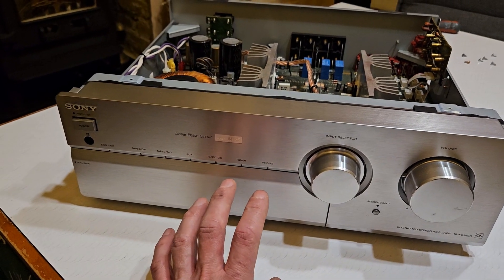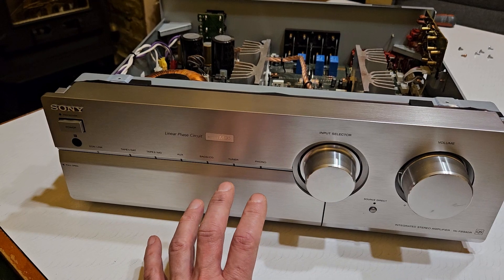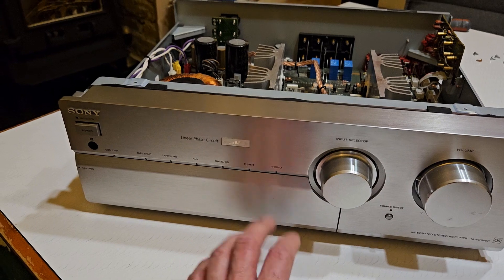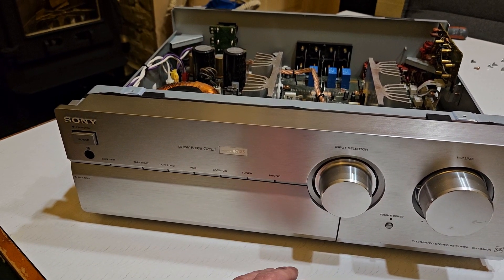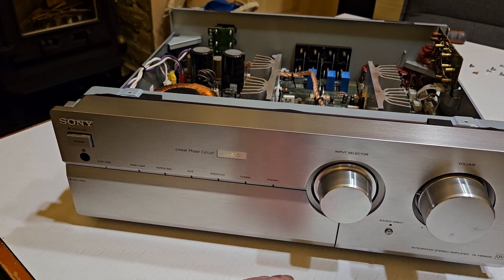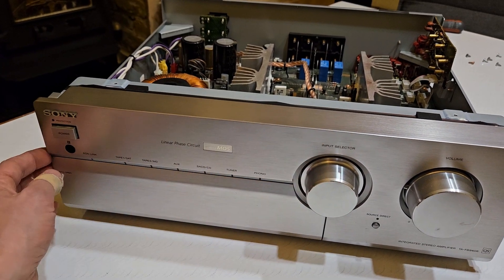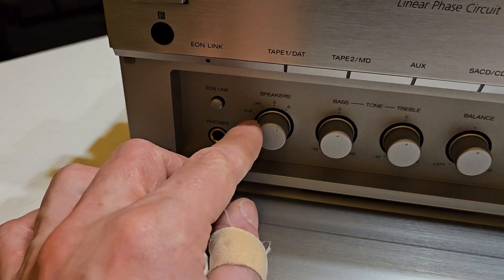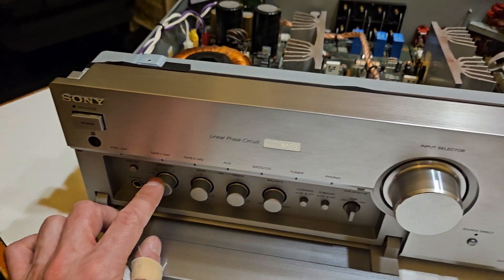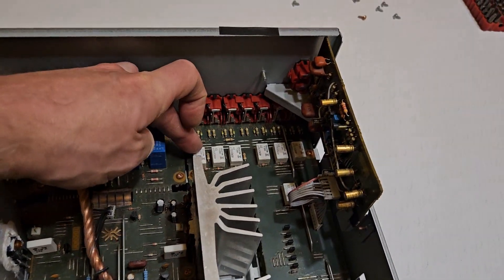What was happening was that the amplifier was working fine, but a few minutes after turn-on, presumably after it had warmed up a little bit, there was a kind of ticking noise and it sounded very much like the ticking of relays. You've got relays on the input which tick, and when you change the speaker settings on or off — A and B — those tick. So those would be the speaker relays here and the input relays here.